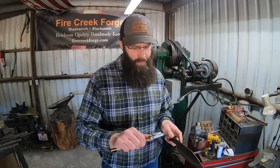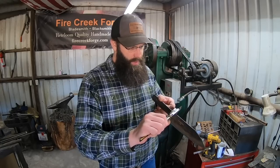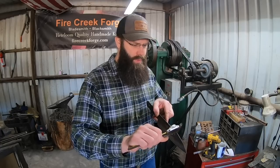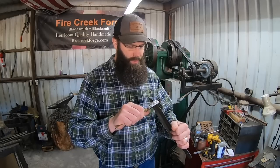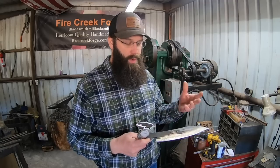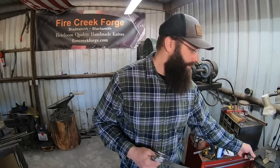But this blade right here, let me pull my calipers out. Right at this point, it's about 87 thousandths, 80 or 79 thousandths, so a very slight distal taper, I suppose. And it's a forged finish, so it's kind of varied. My goal was to make one of these blades in a forged finish. All right, so I still have to make this knife, but